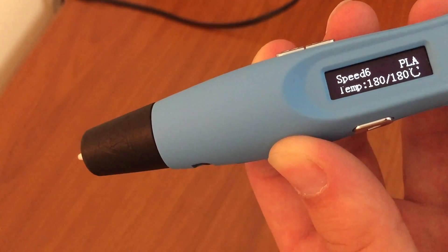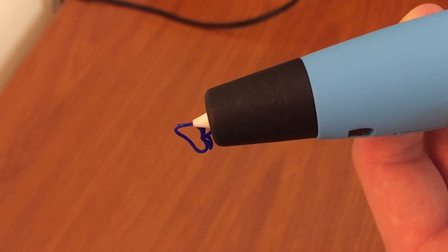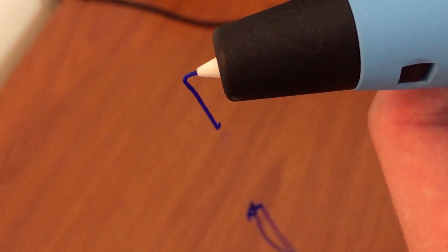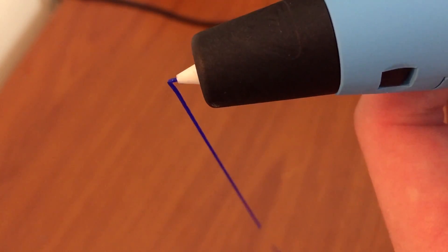First test: speed. How quickly can it extrude? Well, pretty quickly actually. I'd say at least three times faster than the Yaya pen I tested. The speed controls don't actually change the motor speed at all — it's more like a slow PWM style control. It pulses the motor on and off at different intervals, which I think they've done to maintain high torque in such a small geared motor. The pulsing has a very small visible effect on the extrusion but it's not too bad and something most people aren't going to notice.